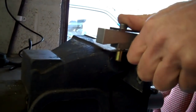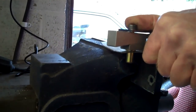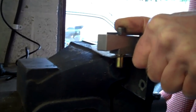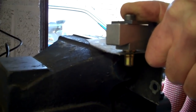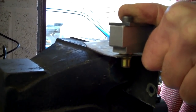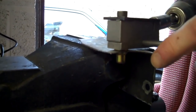It's much better to do it with a socket set than an electric drill, but this should just show us what happens. You should see the underside of that rivnut compressing up as we wind it in. There you go — you can see it's formed a flange on the underside.